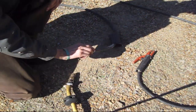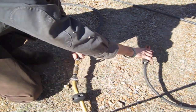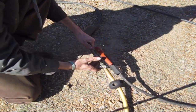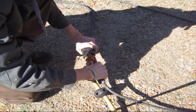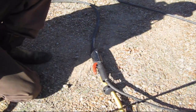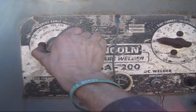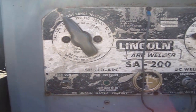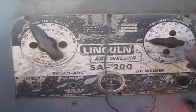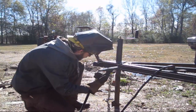So carbon arc is essentially the reverse of welding. So this is all you got to have. Carbon arc has a lug right there where you plug in air and you hook your stinger to from your welder. Now, one thing I want to say about carbon arc is it's very hard on welders. It's a better idea not to use your own welder, which I did here. It's better to rent one or borrow somebody's that they don't care about. But you need a lot of amps for carbon arc. I've got it in 4th gear here, running around a little over 200 amps.